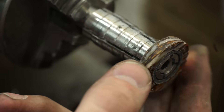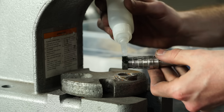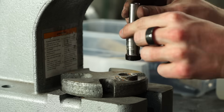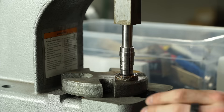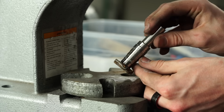Now that we've got it the exact size we need, I'm taking it over to my arbor press. I coat the entire outer surface of the carbon fiber in a medium viscosity CA adhesive, and then I carefully and as evenly as possible press the two together with the arbor press. Once it's set into place, I spray it with some CA accelerator, which sets the CA glue instantly so that we're ready to move on to the next step.